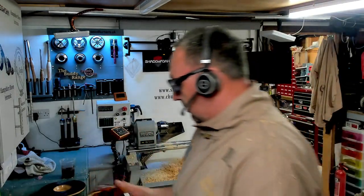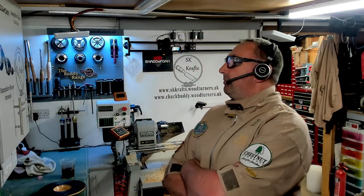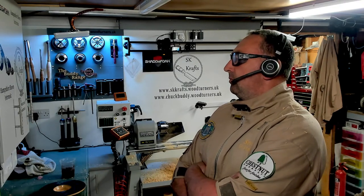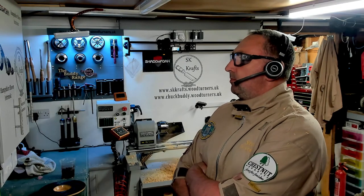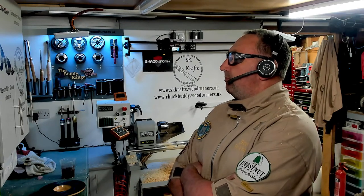Wesley says he's a week and a half into lacquering and finishing a piece. Take your time, there is no rush. If you're doing multiple coats, you need to do a maximum of three, and then leave it to cure for at least 24 hours. That's what I think. I totally agree with you.